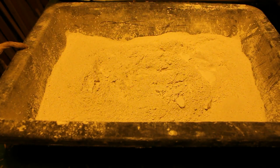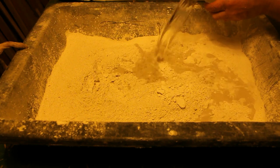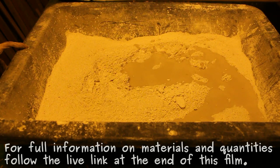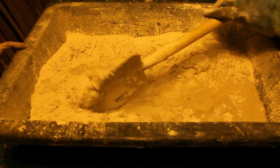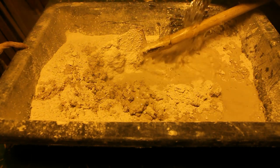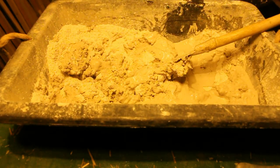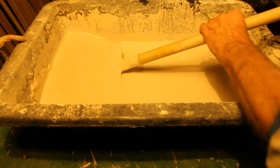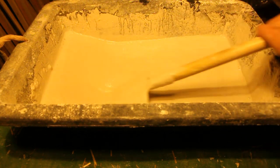First thing to do is to make up the lime mortar. I've made a lot of this in the past for doing the insulation in the house and we use a cement mixer but it's just the same doing it by hand. Being very careful — wear eye protection and rubber gloves because this is still a caustic substance. Not as aggressive as aerated lime but still quite nasty; this is hydraulic lime. What I'm trying to do is to add water into the lime powder and mix it in until I get something like a smooth lump-free batter.